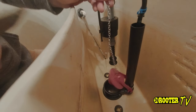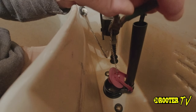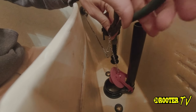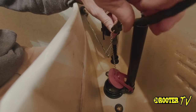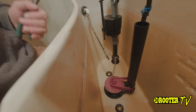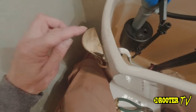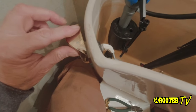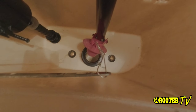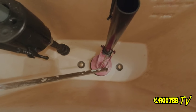What we'll do is cut the excess off of that and leave the chain adjusted. Just want to go ahead and push down the trip lever to make sure it's pulling it all the way up, and it should be good. When you're adjusting this Fluidmaster, you want to make sure your setting is close to the top of the tank as possible, and then go ahead and lock it in place.